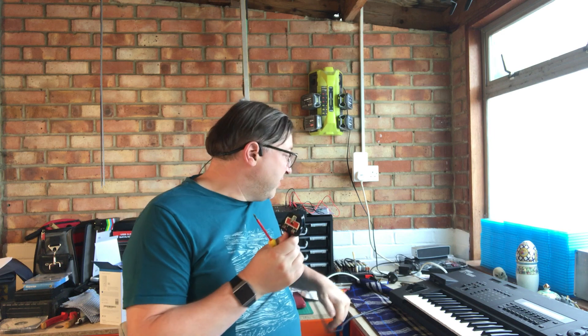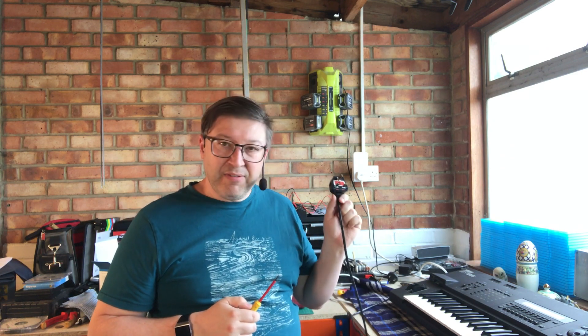At some point this keyboard has been fitted with a 13 amp fuse which is way over the top. Fit the right fuse — fit a very low value fuse — so that if something does go wrong, you've got less chance of frying your keyboard. Part Six addendum — rant over.